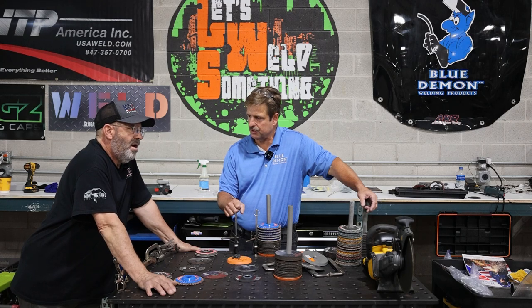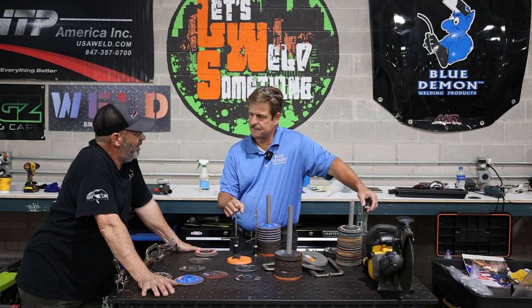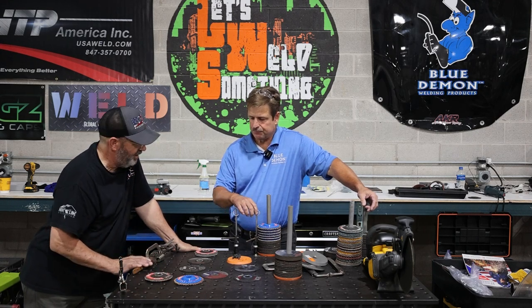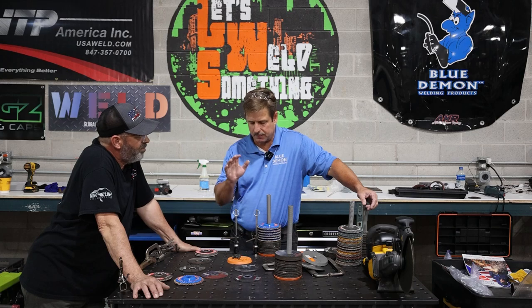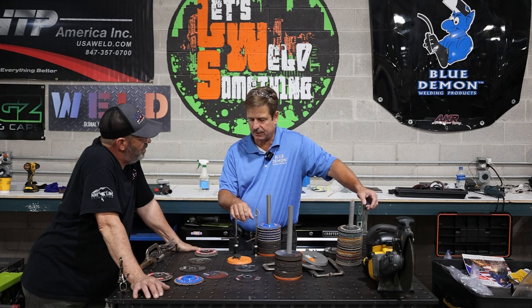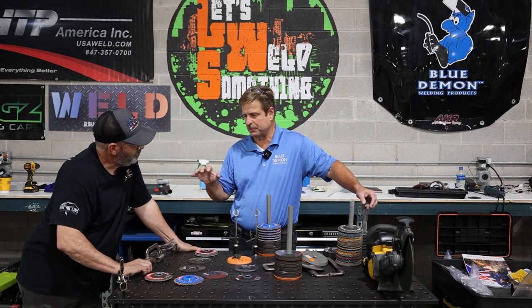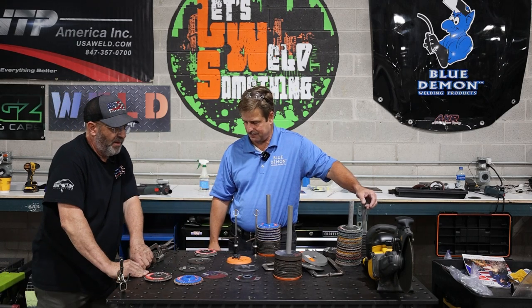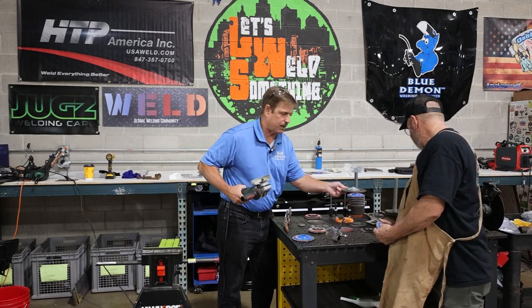What type of finish do you want — mirror finish? I've never done a mirror finish; just clean, then it'll turn gray when we heat it up. The reason I ask is because a lot of times when somebody's grinding welds or finishing something, they want to get it done fast. So they grab the most aggressive grit and go to town — but sometimes that puts too deep of scratches in it and you spend a lot more time bringing it back out.